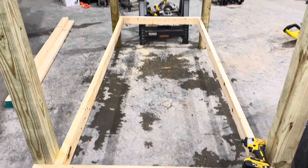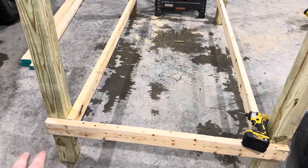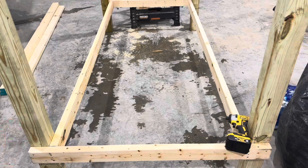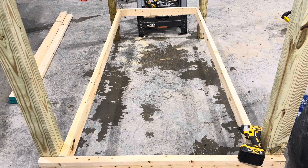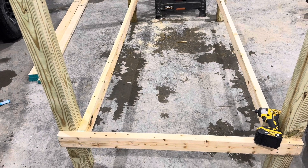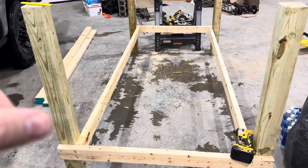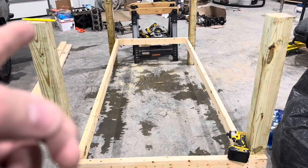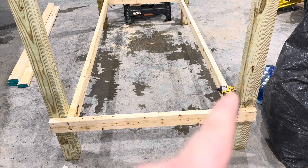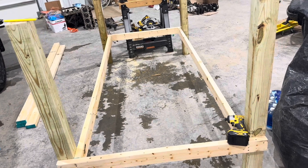As a bonus, I like to add a 4x8 drop-in piece of plywood that creates a lower shelf. I made this one 12 inches from the bottom of the two-by-four, so we're talking approximately 16 inches from the floor. If you have a place that might flood, you may want to go higher. Tools you'll need: a tape measure, a marking pencil or Sharpie, an impact driver — really nice to have — and a circular saw, band saw, or handsaw.